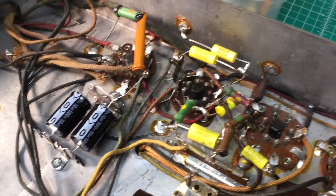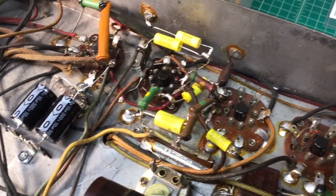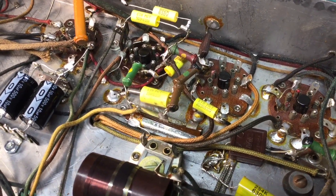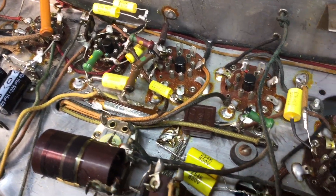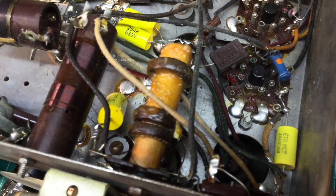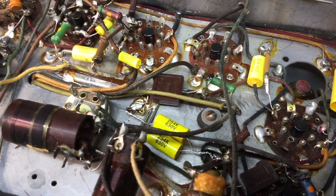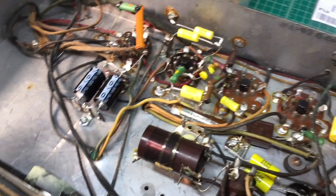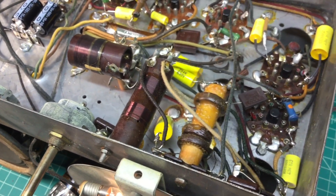At the same time I just did a quick recap on this. I still need to check the resistors - checked a few along the way for accuracy. Most of them were 20-25 percent within tolerance; I may let them be for now. I got all the caps out - at least the majority of the caps are out. Still a few of these mica caps in there with picofarad values - I'm going to just let them be. It turned out pretty good and the radio's playing really, really well.